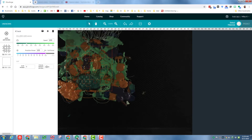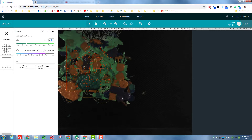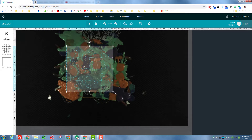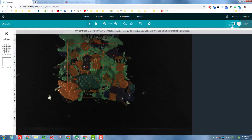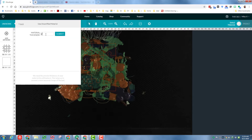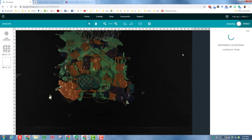For my settings I use three passes, two millimeters thick, and a speed of 200 with 100% power. For the rectangle I have the same settings at the moment but I'm gonna change that to 250 because the rectangle is easier for the laser cutter to cut out. I intend to cut this twice so that'll be a total of six passes before the puzzle is finished. One last bit of arranging to get it all where we need it and we need to select our material. This is an uncertified material so I am just gonna specify the height — my plastic is two millimeters thick. Just watch closely to make sure the alignment stays the way I expect it to, and then let's hit that magic print button.